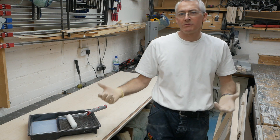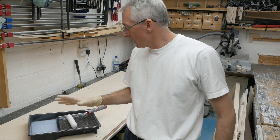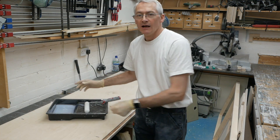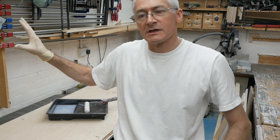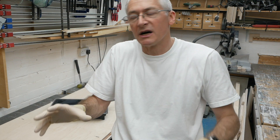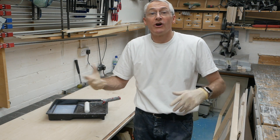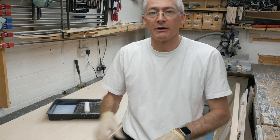With everything sanded back and wiped down, I'm ready to start getting a clear topcoat on this. Now the eagle-eyed amongst you would have noticed I do not have my sprayer set up - I am back on a roller and tray. I'm not giving up on the sprayer, it's just that at the moment this is a clear coat on top of birch ply, whereas the spray booth that I made is just covered in white paint and I don't want any kind of transfer of little bits and particles. Plus I haven't used this lacquer in a sprayer before and I want to try that before scrubbing up the finish on this.